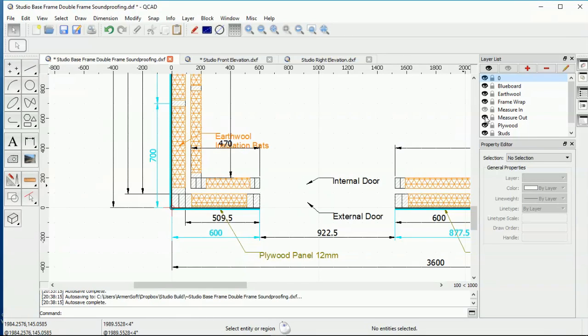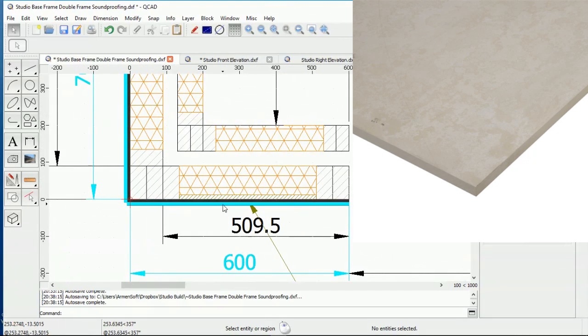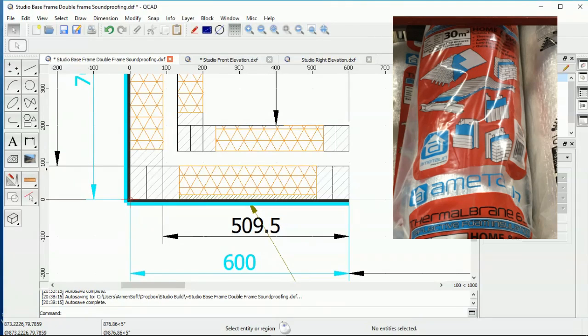And very briefly to go through, I have my wall, which is a fiber cement, this blue one here, that one there. Underneath that one, between the frame and the outside fiber cement wall cladding, I have 8mm thick special foil wrapping material that not only stops any moisture coming in, it also has thermal insulation as well as some noise dampening characteristics.